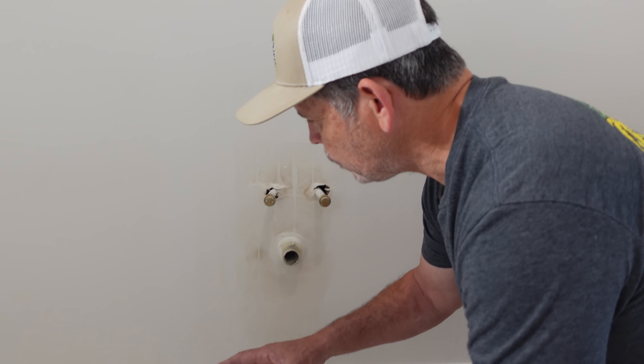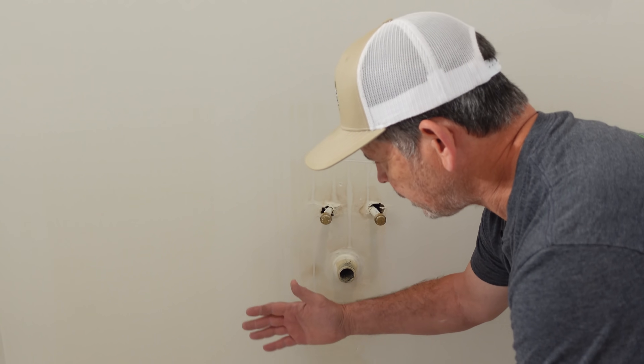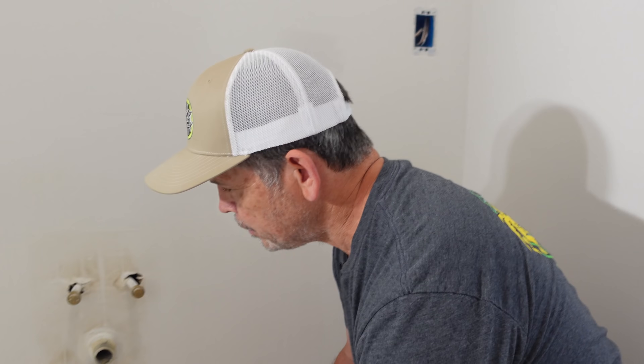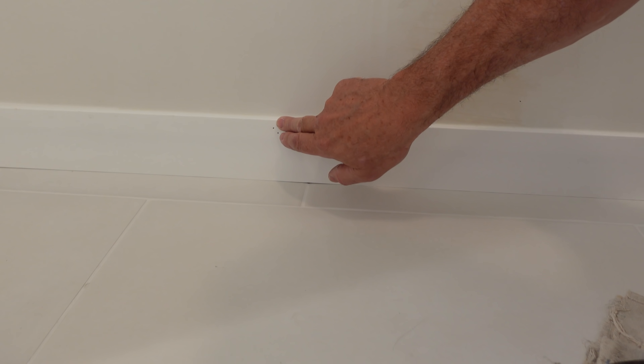It's the next day and all our caulking is dry. We've made the illusion that the wall is straight by making the baseboard straight. We used the nails as a clamp while the glue dried. If your eye references the baseboard against the grout line — which is perfectly straight — they are parallel, so we did our job. Our next step is to paint, but first we want to fill all the nail holes, give it a light sanding, and a coat of primer before we put the finish color on.